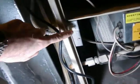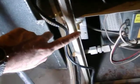On this furnace the bottom panel just lifts out once the top panel has been removed. There's a safety switch here that pops out when the cover is taken off, which makes sure the furnace can't run while we have the cover off. In the bottom is the blower assembly.